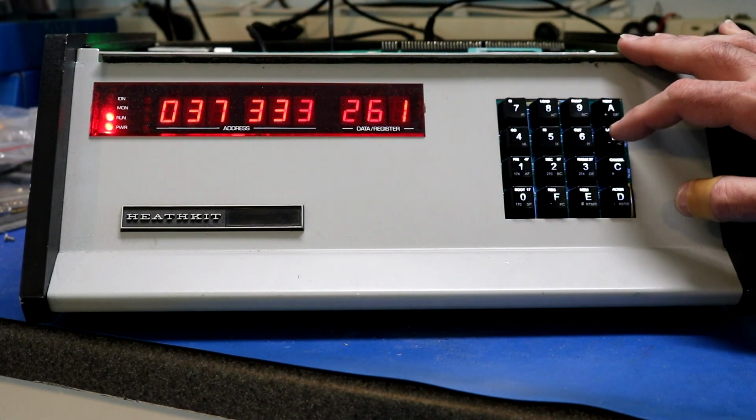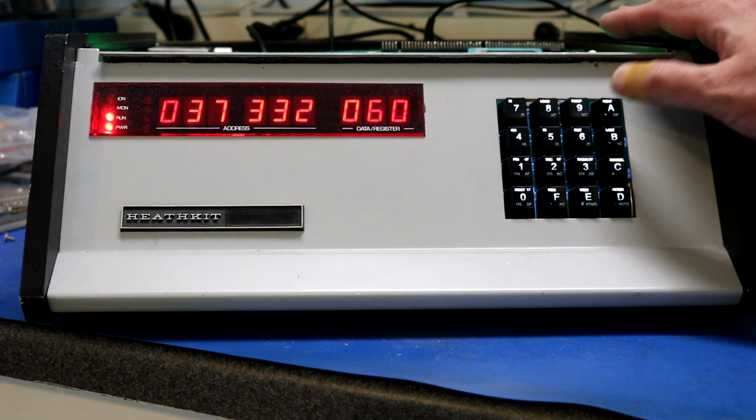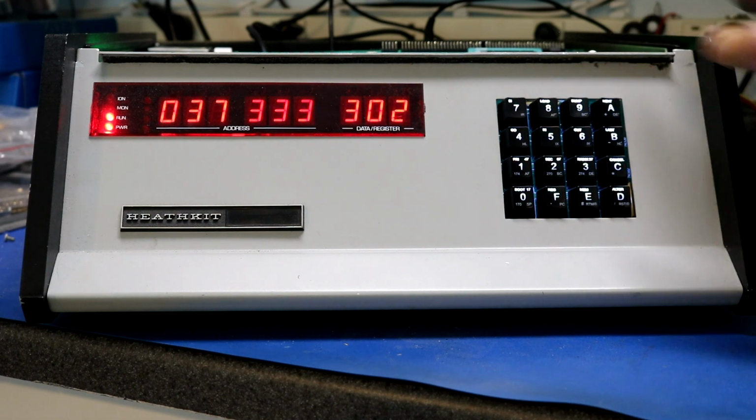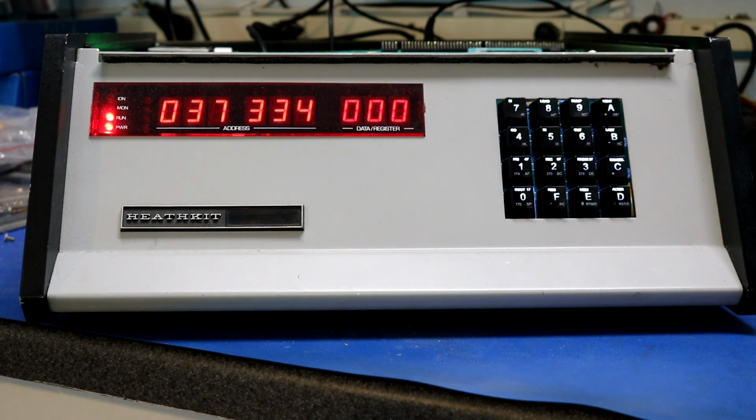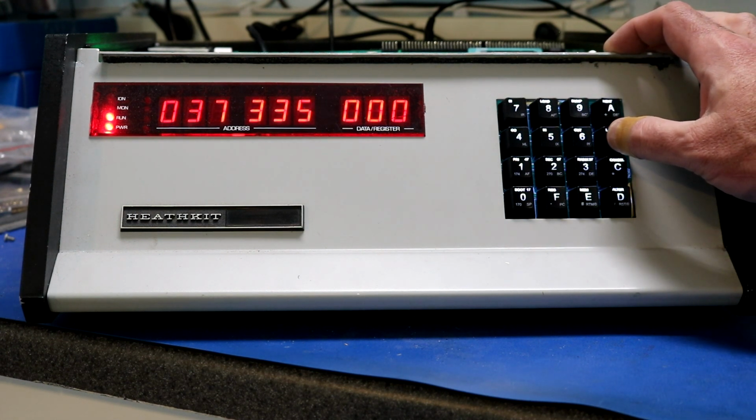We can go backward. That's the first byte. This is counting the 5 millisecond refreshes. You can see it's going by faster than you can read it. We've got the second byte there. The third byte, we're getting toward the more significant byte, so it's going to be a while before this one sees an increment, and then we'll have a fifth byte, or a fourth byte, if you let this sit here and run for a long time.